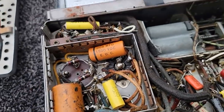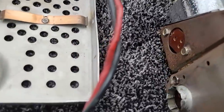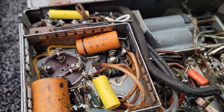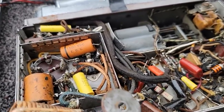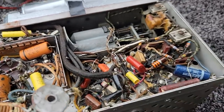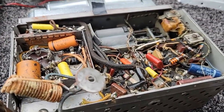We have a vibrator running! I don't know if you can hear it over all these birds, but I'll push the phone up against it. So that's a really good starting place. Ideally, that capacitor and those two resistors should be replaced first before anything else. I learned that on my last tube car radio video — I knew about the suppression capacitor that keeps the points from burning in the vibrator, and those two resistors as well.